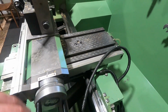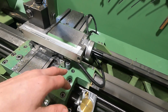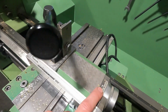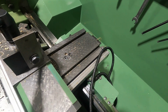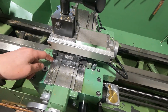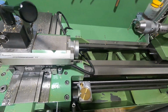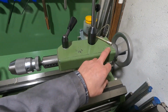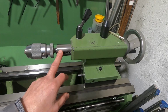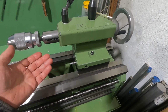There were originally oiling ports, those 2 for the bed slide, and they were really rudimentary in terms of routing oil to the slide surfaces. There was one original oiling port here, one here. There were no oiling ports for the sliding surfaces. The instructions just said to oil them from the outside regularly, and you know how well that can be done. The tailstock had only one original oiling port, which was here, and the quill was intended to be oiled just from the outside, which, you know, you can only do so well.